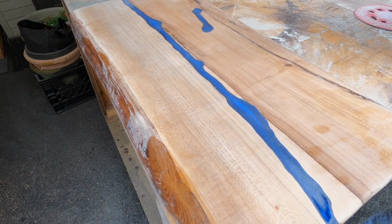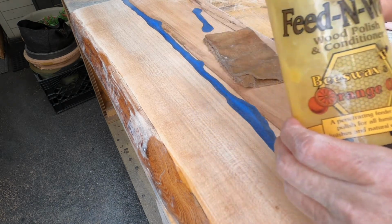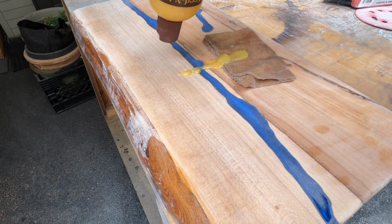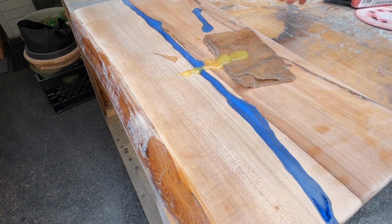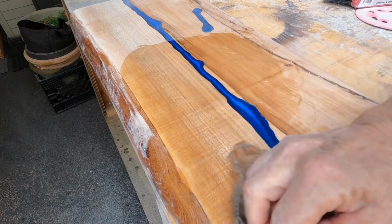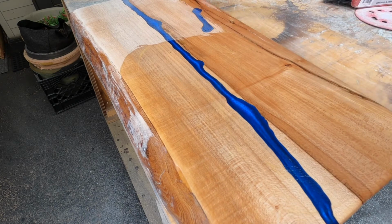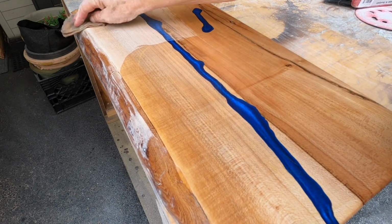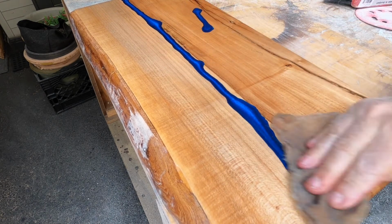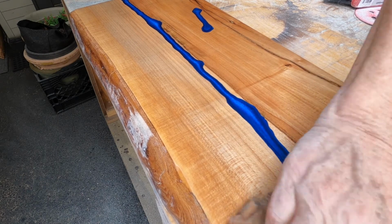Sometimes I will take a piece of paper towel or workshop cloth and put naphtha on it, or use a tack cloth, and that sometimes pulls off some of the dust. But because this maple was so hard, I really didn't have those issues. So I just swept it off with the little broom there in my hand. I knew it was pretty dust free, and I went over it now with the Feed-N-Wax, which is a great product. I'll put a link below to that in my description.